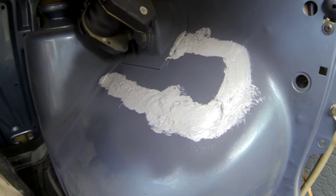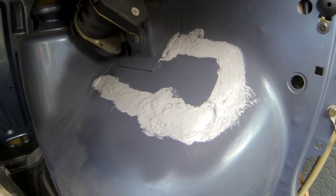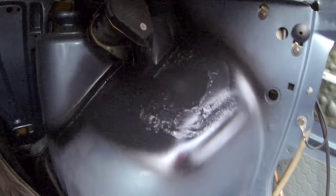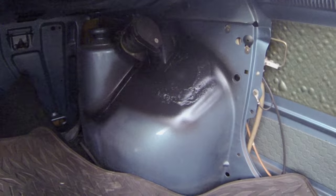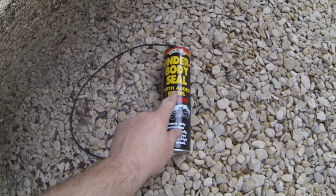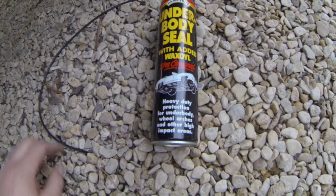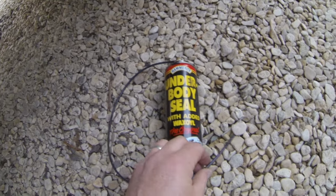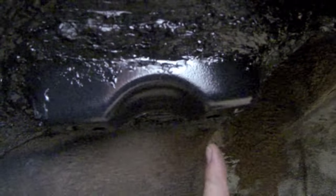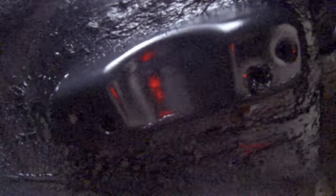When you're welding something, think outside the box - think about where the weld is going. We welded on the inside so it's burnt off the paint inside. Edge prime, seam sealer, let it dry, and then stone chip on to keep the protection from inside. For the big holes what you need is some underbody sealer - a little tube with a brass nozzle with little holes that shoots wax out in all directions. Shove the end inside the holes and just fill it up until it's leaking out - that will give it its protection.